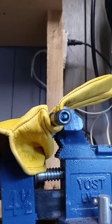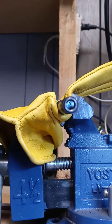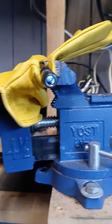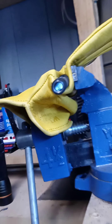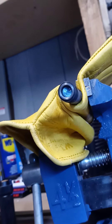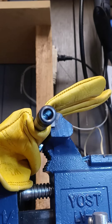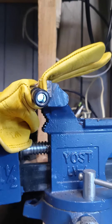You'll also notice where they've misaligned the centering of the rifling. If you notice right here on this side, you see that ledge right there. If you follow it down, you see that ledge there and you'll notice how it disappears right into the smooth side of that barrel on the other side where the alignment appears to be a little better — it's clean and smooth on the way up there. You see how that ledge begins to start back there and it increases as it goes around. Misalignment from the rifling of the barrel is also a factor in inaccuracy.